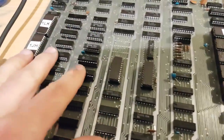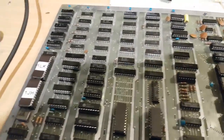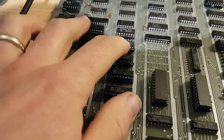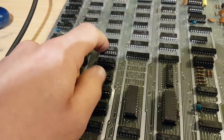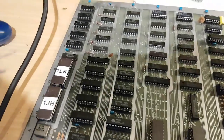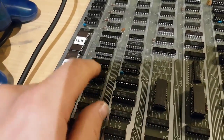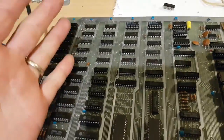All right, folks, so I did something very, very silly in my previous section there. I was looking at all these chips here on the video sprite lines, but I had a hunch it was one of the 157s or these guys, the 194s, and I started replacing one which I suspected was wrong, and it tested fine. Anyway, long story short, I got caught up in the action and ended up replacing the whole bank. Now, I'm sort of glad I did that, because some of them had corrosion underneath. It doesn't hurt. But the original chips are fine, so I actually put them back in.